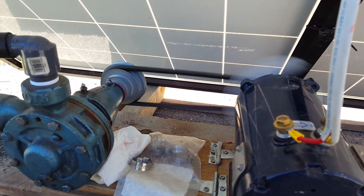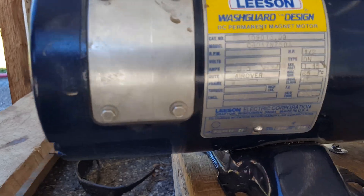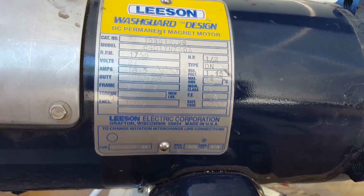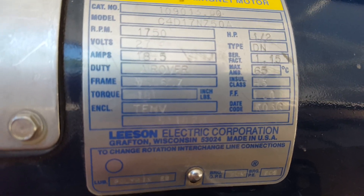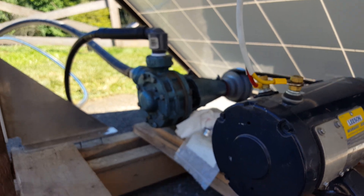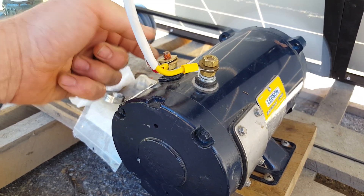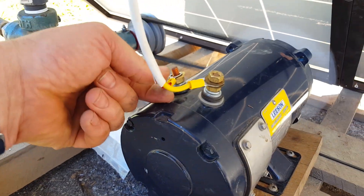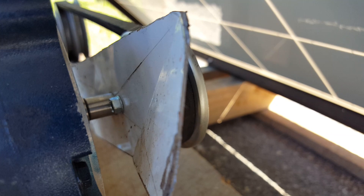The second lesson learned was that I let the motor run on its own and realized it was getting really hot. I took a closer look at the data plate and it says the duty cycle is 'air over' — I'd never seen that before, but I figured it meant the motor needed airflow to cool itself. So I went and cut a piece of sheet aluminum, put some self-tapping screws in to hold it in place, bent the blades, and made a fan.